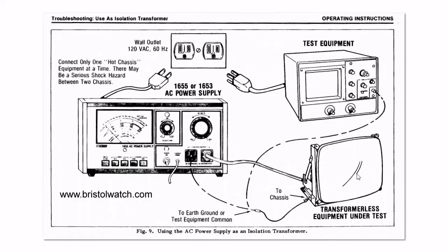It can also act as a plain isolation transformer. With your television chassis, you can sometimes connect the earth ground to the chassis if you want to — I never did. I always used it through the isolation transformer when doing troubleshooting.